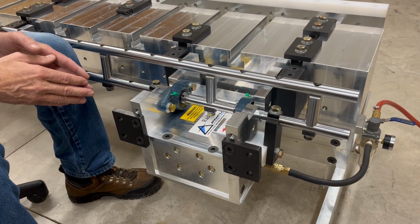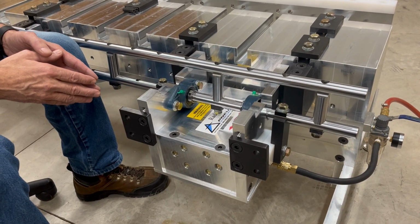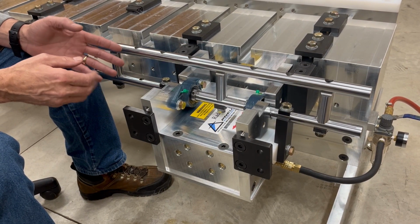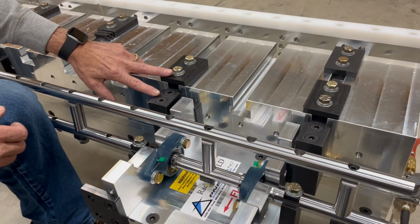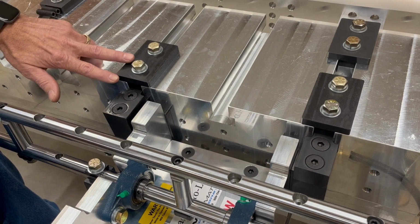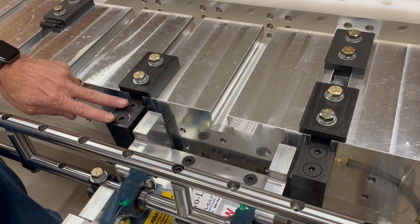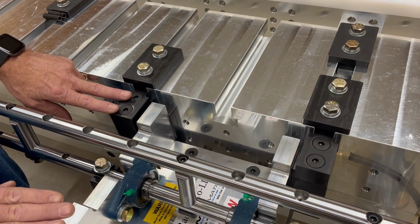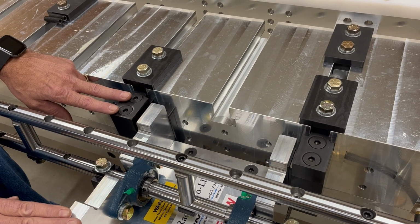Another feature of your Radial Pro system is that there are 2 available mounting options for fastening your shaker system to your press bolster. One option is adjustable T-slot tongue mounts. Now these mounts are on 12-inch centers. They include clamp plates with fasteners, and they are adjustable upward or downward 1 inch, which will raise or lower your shaker 1 inch from the neutral position.